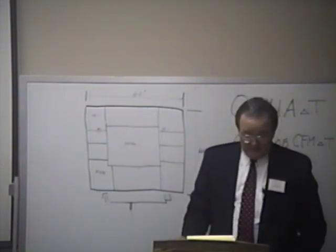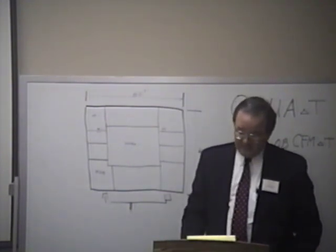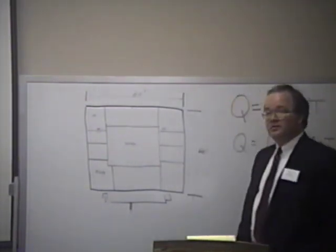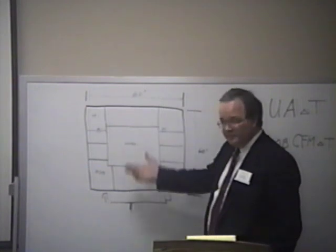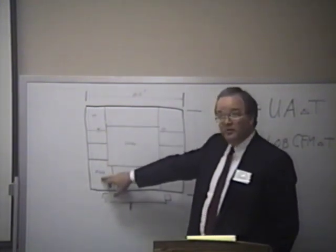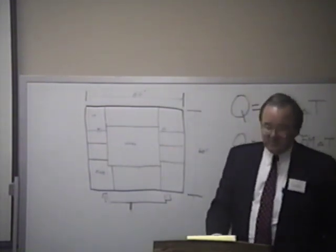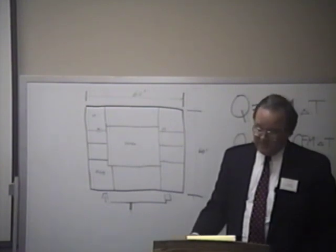Just an example. Have someone test and adjust your central heating system and clean it. This is talking about air balancing. We talked a little bit about air balancing today. This building right here would be a perfect example. If this were, say, 10 years old, additions have been made, things have been added. The fan is off of its fan curve. You're getting a lot of air in this space, not enough air down here. This fellow might have taped over his diffuser and he likes it warm. All kinds of things happen that can disrupt the system, and it really would pay to go through and spend some time cleaning the ductwork and adjusting the grills, and maybe looking at where grills have been totally closed off, things like that, just to get the airflow moving through the space.